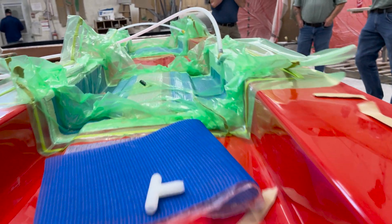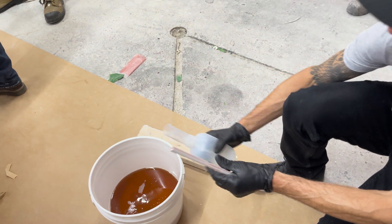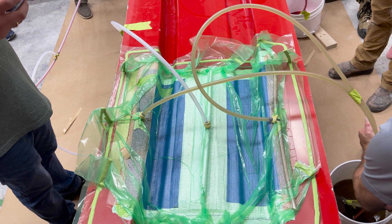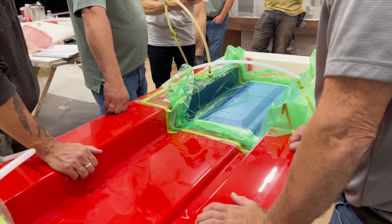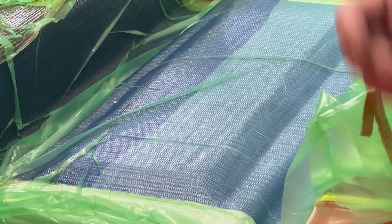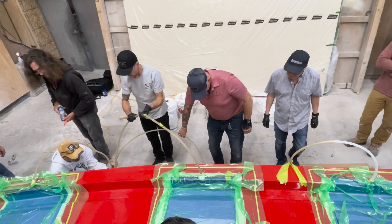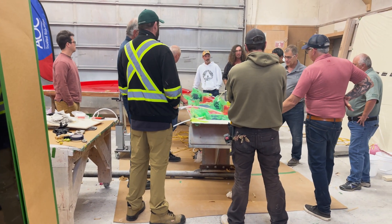What's unique about this system is that everything is under vacuum — the only smell we have is in a small bucket where we inject our material. It's all injected at one time. We don't worry about rolling out in an infusion process; it's all consolidated, vacuum takes out the air, and there's no manual work once we have a perfect vacuum, versus the hand manual process.